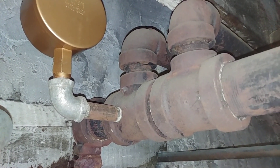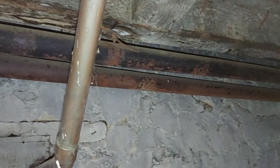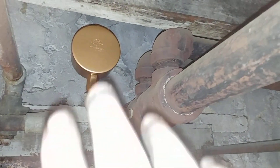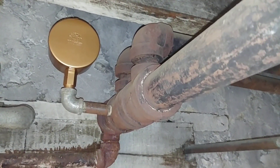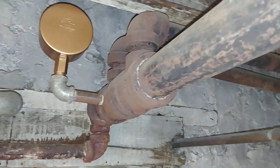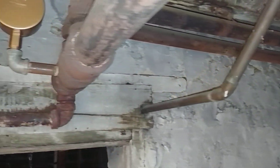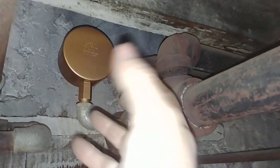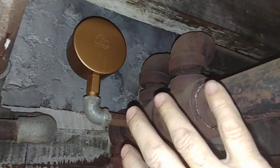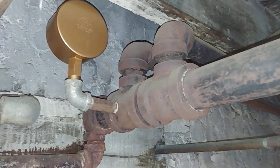If you overvent a radiator, you're going to be creating a lot of condensate, which will have to flow back down the pipe as the steam is trying to get to that big hole on the radiator. Sometimes people try to get around not having main vents by putting heat timers on radiators. They're huge, and they just draw the steam right to the radiator. The steam then condenses inside the radiator, and all that condensate has to roll back down as the steam is trying to roll up. So if you create a low-pressure zone at the main vent, you sort of trick the steam to get there first, and then once it shuts, the steam goes to the radiators. It's a two- or three-step process.